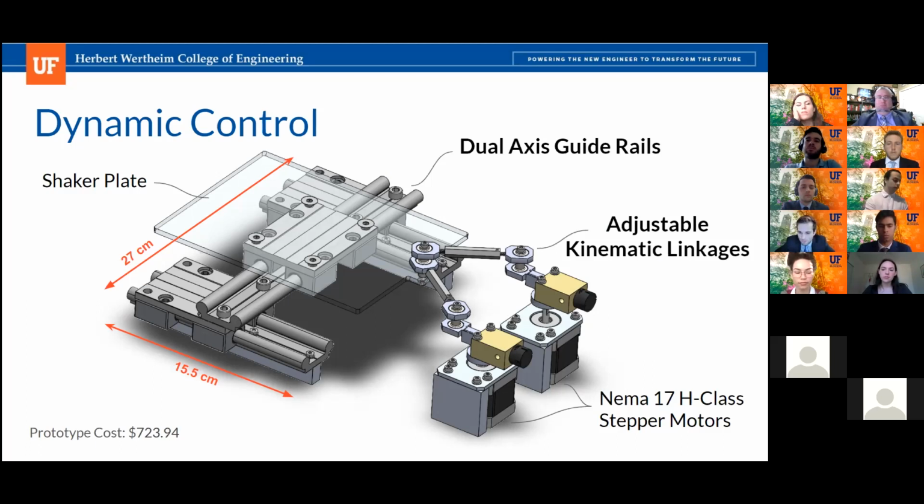Yeah, I mean, nothing here stands out as particularly low frequency. I think you said you were hitting like 300 RPM or something, which is, well, I guess, 5 hertz. And there's nothing in your system that jumps out at me as, hey, I'm a cantilevered beam with a heavy mass on the end, so I'm going to have a really low natural frequency. But just something to think about a little more rigorously than what's here.